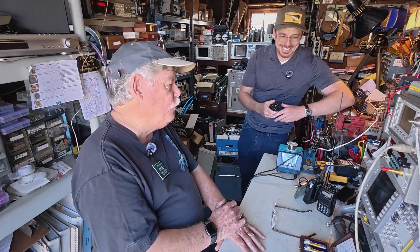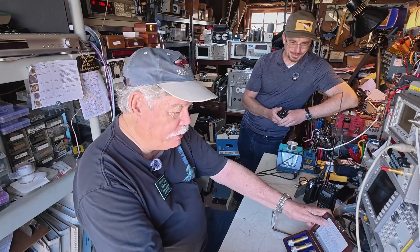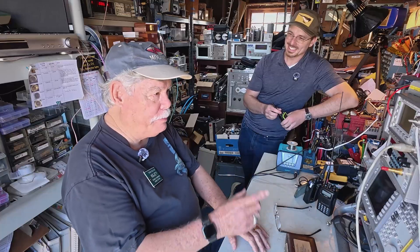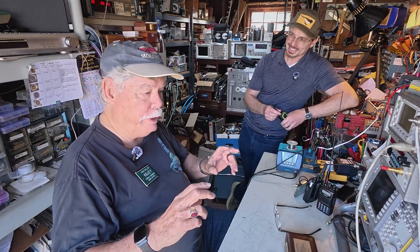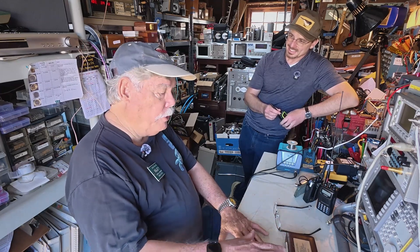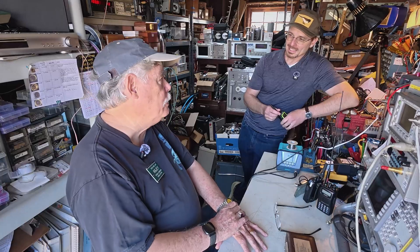We can do that. I can get you well within one dB of everything we're going to measure. I have a nice attenuator that's been calibrated, and I have some metrology-grade type-N attenuators. We'll put those in line and then put it on the power meter and the spectrum analyzer, make sure all our measurements between 100 megahertz and 1,000 megahertz are accounted for. The harmonics are all calibrated. It sounds pretty simple, but it's going to take some careful measurement. The analyzer is good to a half a dB, and these are good to a couple of tenths of a dB. So we should get some good results.